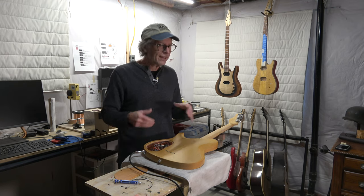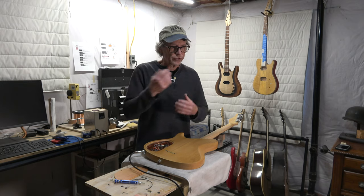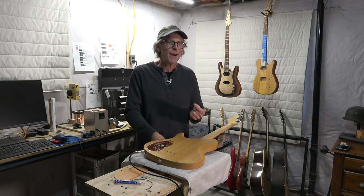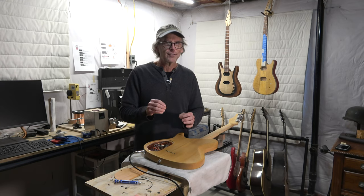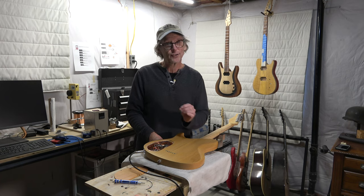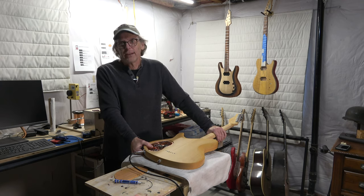Now it makes me wonder what happened when I allegedly fixed that Les Paul that had buzzing, which I thought was caused by a ground loop. In truth, I think what happened is yes, I eliminated the ground loop, but I also re-soldered all the electronics. So there's a good chance that I fixed a bad solder joint in the process, which eliminated the noise. We have to eat crow at some point in our lives.